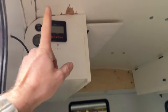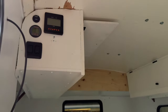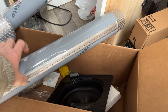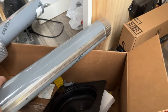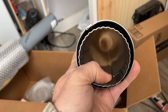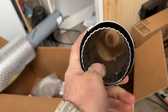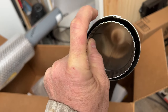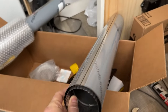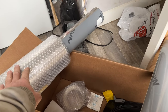Once I marked that spot on the ceiling, that's where I'll go up through the roof. I'd highly recommend buying the pipe from the Cubic Mini manufacturer. I love the double-wall design — it keeps soot going down inside while completely protecting from smoke coming inside, with an insulated section to keep it hot as it exits outside.